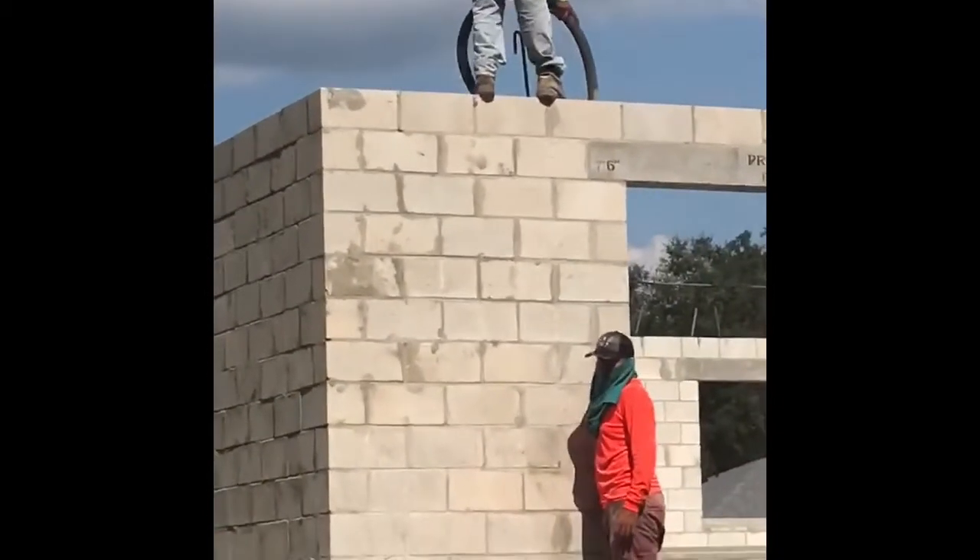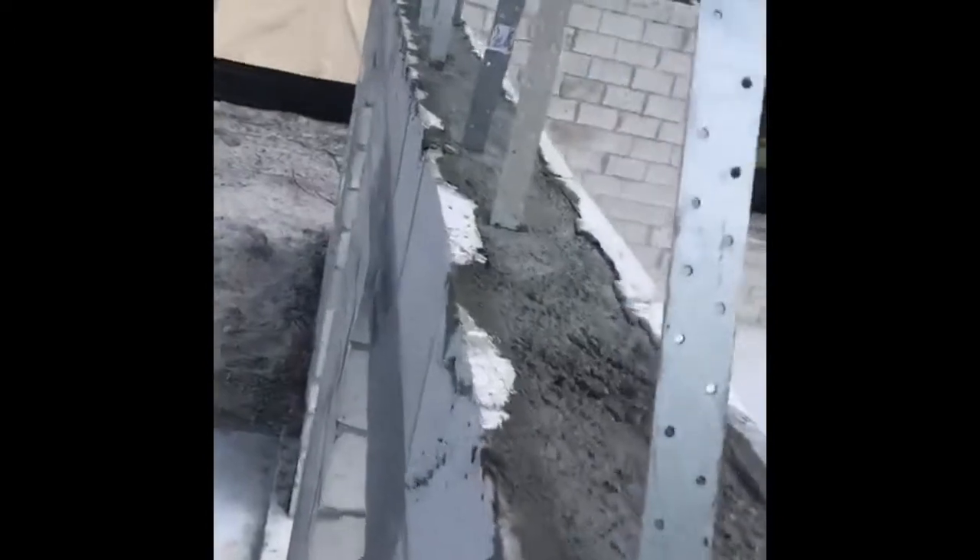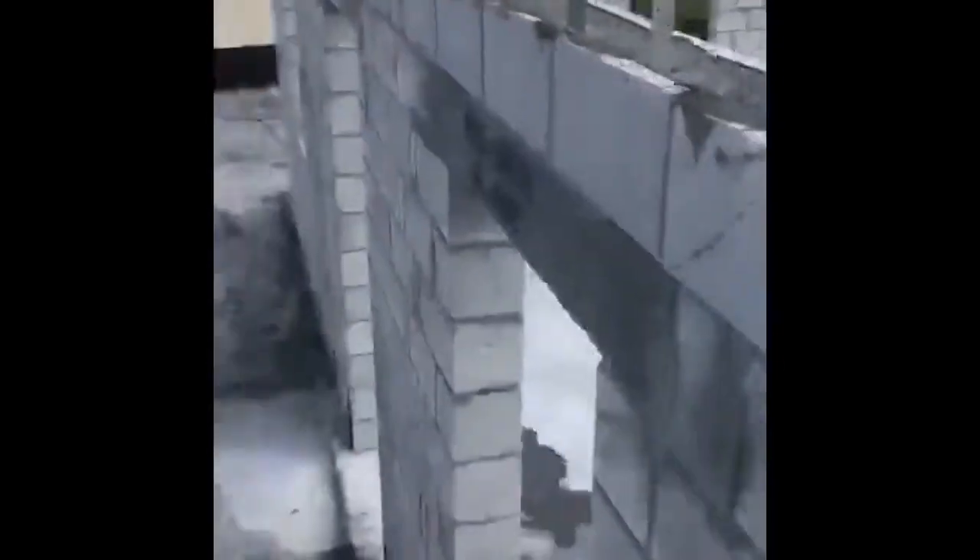He continues to move along the top, filling the lintels. I'm on top of the block and you can see all the hurricane straps. They filled the lintel with concrete around the entire perimeter of the home. Each of those X's around the house has a hurricane strap that will have a truss attached to it. They also removed those wood covers, and you can see that proves the concrete is full from the bottom to the top in each one of those areas.